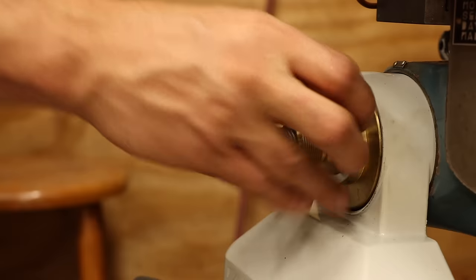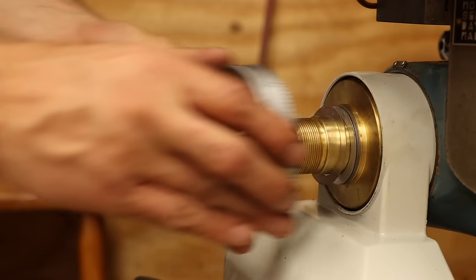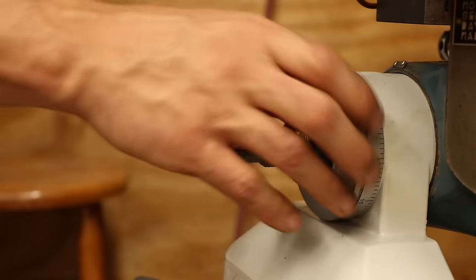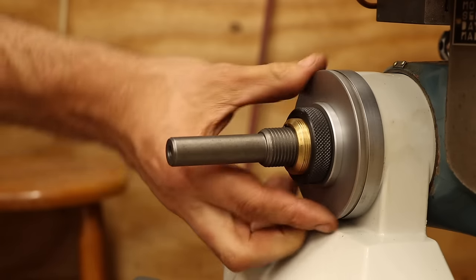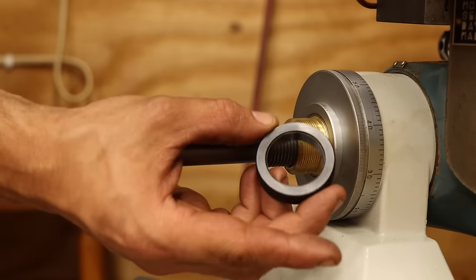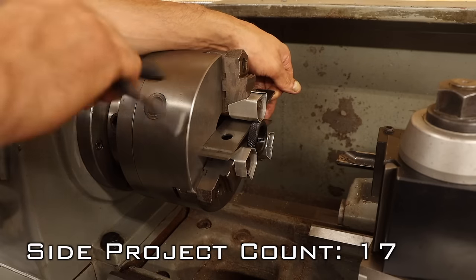Excellent. This gets the shim treatment as well, and then the locking ring is threaded in place. Which, of course, doesn't lock anything. Why am I not surprised? The problem is that the ring runs into the hub shoulder before engaging on the dial. But this is a simple enough fix on the lathe.